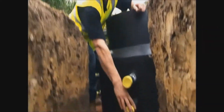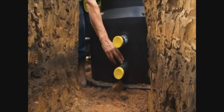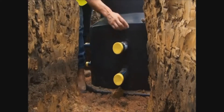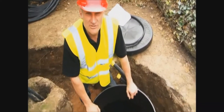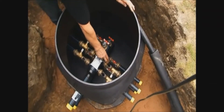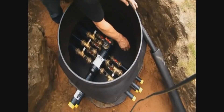Here we can see this is the main return from the heat pump within the property that goes through the manifold, back down through the loop, warms up in the ground and comes back through the manifold again, back through this main flow to the heat pump itself. With the top of the manifold off you can see how the ground loops are all connected together through the main flows into the property and return back from the property, back down to the loops.